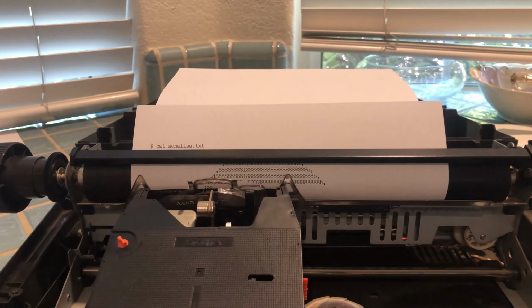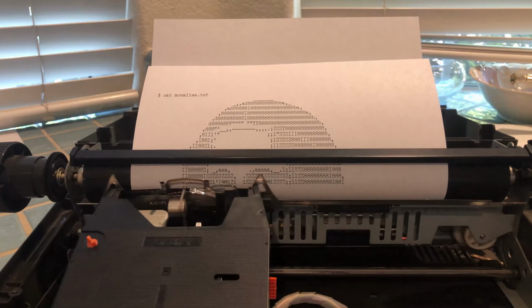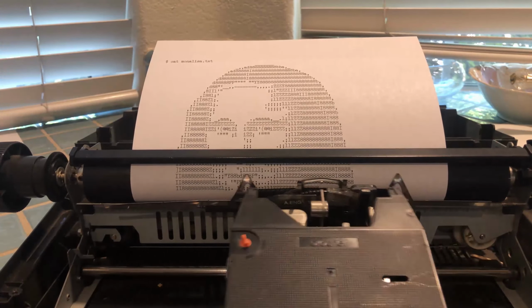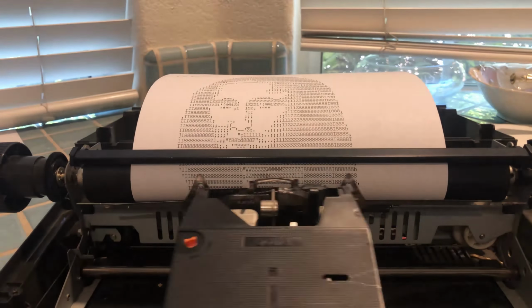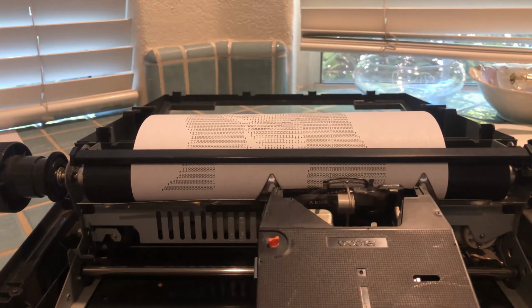With these updates, I can finally move on to connecting the typewriter's keyboard to the Arduino. I think I've finally figured out how to do it. Conveniently, the connectors for the keyboard's cables have the same spacing as the holes in a breadboard, so I should be able to remove the connectors from the typewriter and wire them up using 2 more multiplexers on a breadboard. Once I've done that, I just have to write some code to read the channels of the multiplexers one by one so it can detect which key is being pressed.